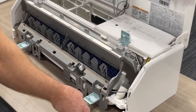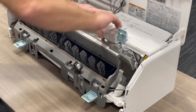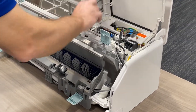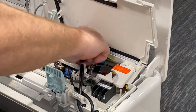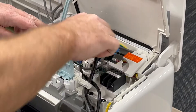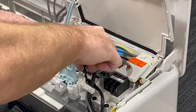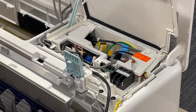Take those loose. Before you do anything else, you need to take your electrical panel and prop that up. There's a little prop rod right here, because your blower motor harness and your louver motor harness need to be disconnected in order for you to pull the blower out.